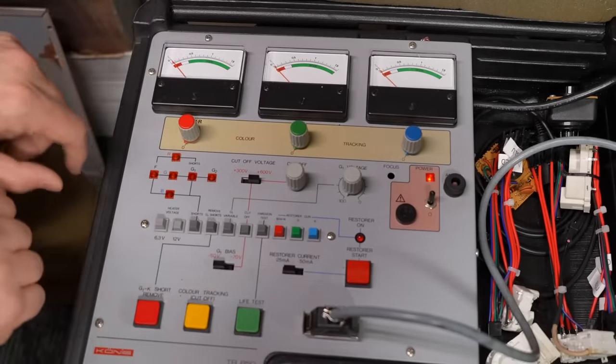For the final configuration, we have the Apple II clone that I worked on so much, and the monitor sitting on top — it kind of looks perfect. Let's turn the computer on. Yes, I have the diagnostic ROM running. The video output on the clone is so much dimmer than it is on the IIc — that's fascinating. No problem though, we can just turn up the brightness. There's a toggle switch on the back to put it back into normal mode. Apple II — the machine booted. I also have it connected with Total Replay on a smart port device. It freaking works and it looks good. There's Lode Runner — let's hit enter to run this. This thing is just great. This is a great monitor. I'm so glad to have saved this.